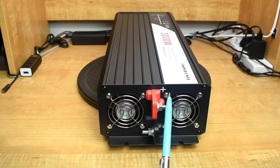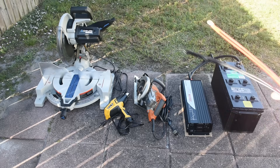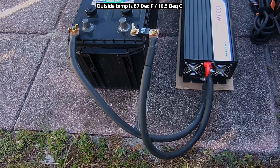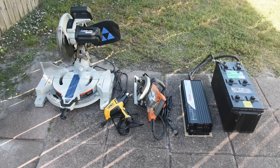We're all connected up. I have my 4D lead acid deep cycle battery connected to the inverter. I chose not to use the included cables but the ones I showed you how to make in a previous video — they're much thicker, 4-0, and can handle a lot of current. For the first test, I want to see how well this inverter handles inductive loads and high inrush currents. I have a Ridgid circular saw, a Delta industrial chop saw — the exact same chop saw the Reliable brand inverter could not start — and we're also going to connect a microwave oven.